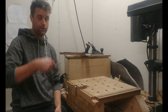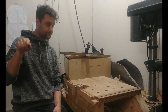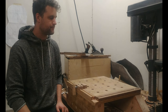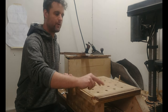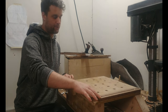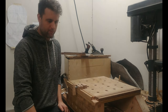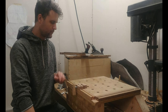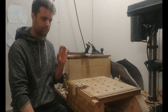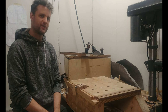The T-track allows a T-bolt to ride on the inside — the profile looks like a T, and that's how work-holding pieces are held in place. I have one made of maple and one made of elm. I would not do elm again — it's a little too squishy and it's hard to get the T-bolt out sometimes. The maple one seems to be holding up pretty well, but probably aluminum ones from the store are the way to go. If I did this again, I'd just buy the aluminum ones and get a lot more use out of them.